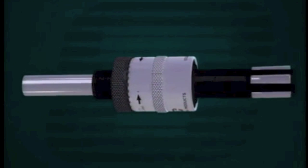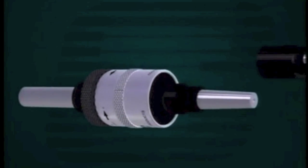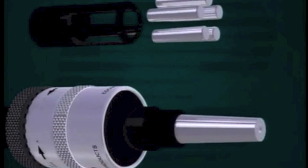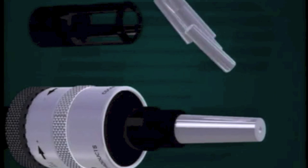The internal roller finish tool is representative of the entire roller finish family of standard tools. The parts of the tool are the tool body and shank, the mandrel, the cage, and the rolls. The tool shown here has five rolls. The number and size of the rolls varies from tool to tool.